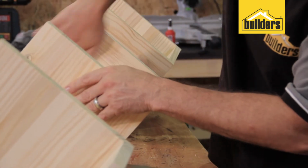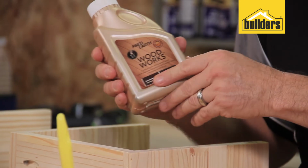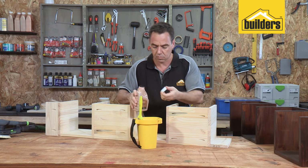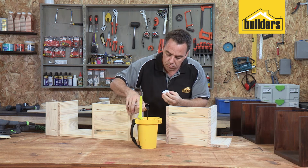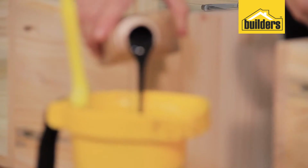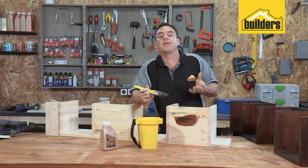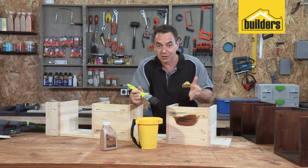It's up to you what color you choose. I used the water-based fired earth wood sealer with a built-in stain of burnt brown. There is a range for you to choose to suit your preference and style in your home. Make sure you apply at least 2 coats. When it comes to stain, you basically have 1 chance to get it right.